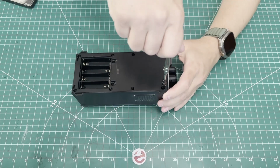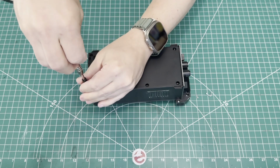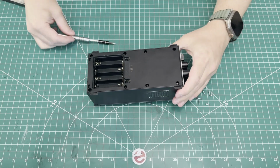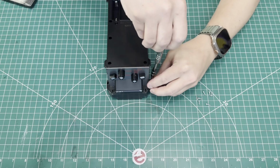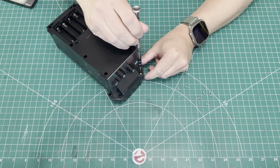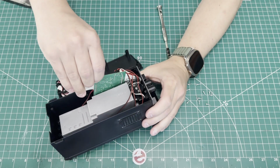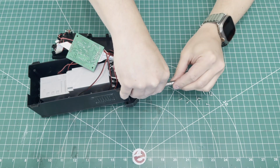and going through the process. So, watching me turn a screwdriver is bad TV, so I've sped the process up slightly. Once we get all the screws out, you can then get the front Allen key screws out of the front plate, as well as the 4 screws underneath the bar graph. That will enable you to pull off the base plate and pull out the main board. You want to be ginger careful with this so you don't break any connections.